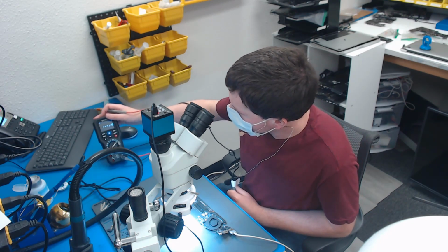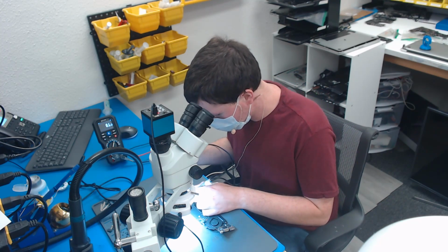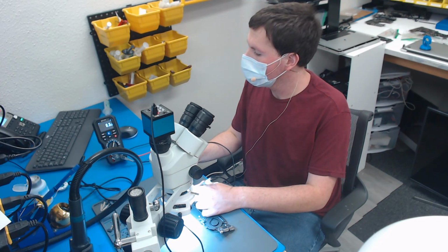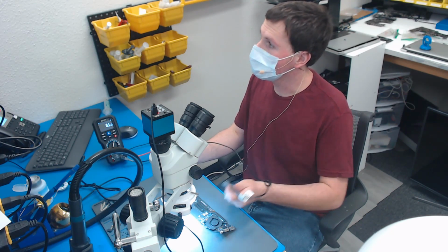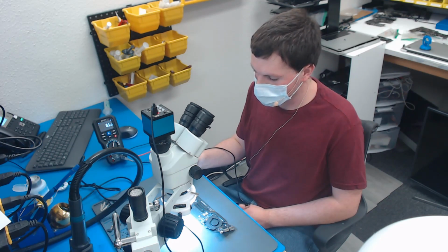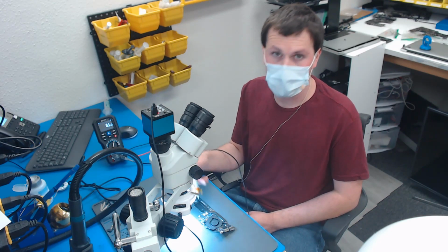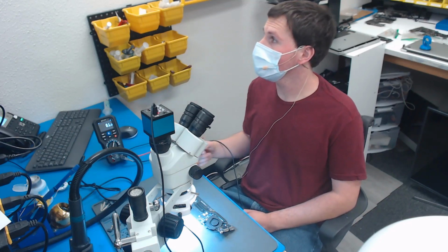So let's go over to diode mode. Let's unplug our adapter, and let's check for a short. And what do you know? We actually have a dead short to ground, so 0.2 ohm short to ground on PP-Bus G3 hot. Most likely this is going to be a shorted tantalum cap. So we are going to inject voltage to that fuse, take some thermal images, and see which capacitor is shorted. It's probably going to be a simple repair, luckily. So let's jump right into that.